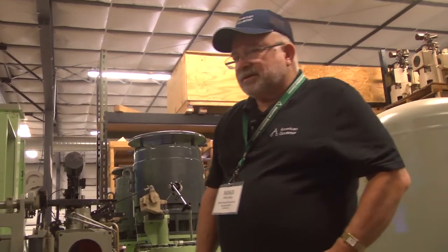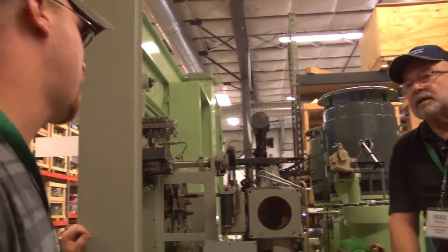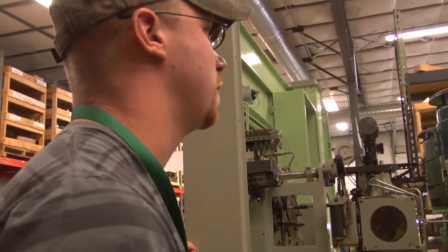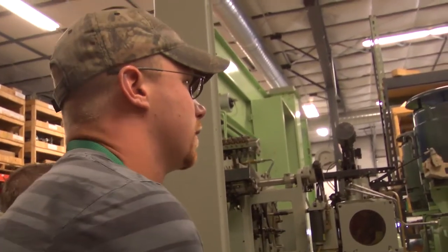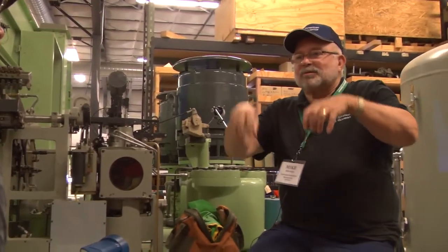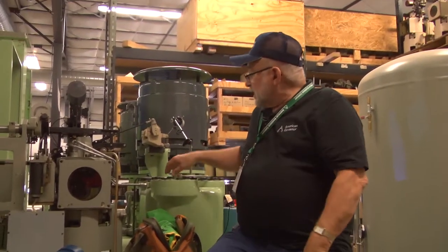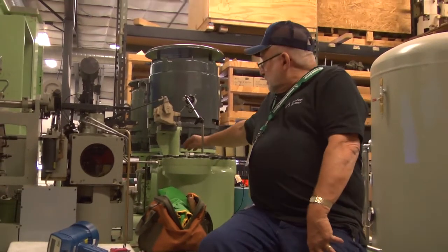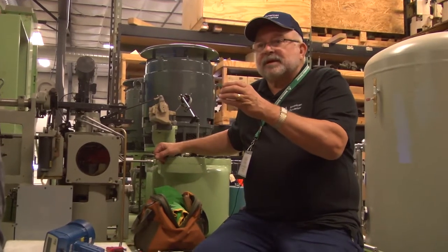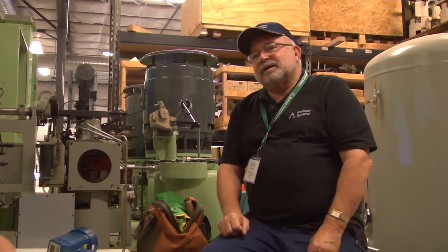Yeah. Well, I've had ones where going to transfer back to the main, and something happens in the transfer valve, it won't. The handle feels like it's in, but you can't move nothing. You know, a lot of times what that is they've been running in one spot a long time, and those poppets won't seat good. So if the poppets stay up, it can be dirty. And you're open and close, they can be dirty or the rings can be all gummed up. A lot of times the way I do it is I just go back and forth and pop those babies. That's what we did. And it'll come free.